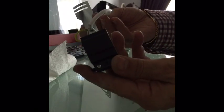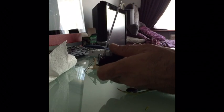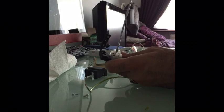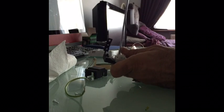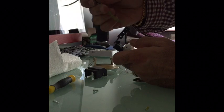This is the connector box. There are a couple of screws on there to remove, and also a cover that you can remove. You just place the earth wire in the middle of the connector box, since that's the one for the earthing. It's always best to earth these things because you never know when you might get caught out. Some people avoid doing the earthing, but it's not advisable.